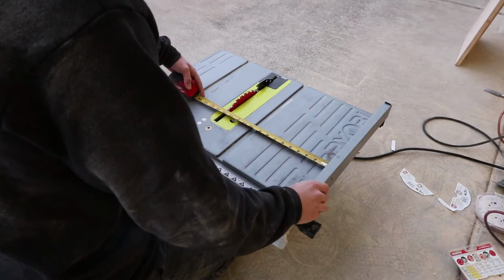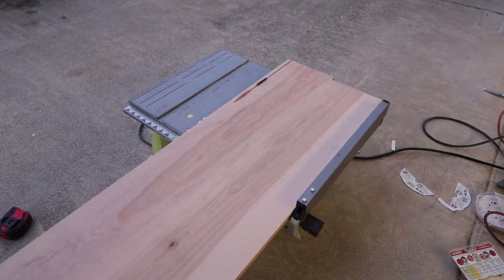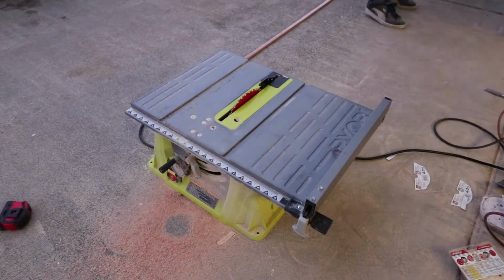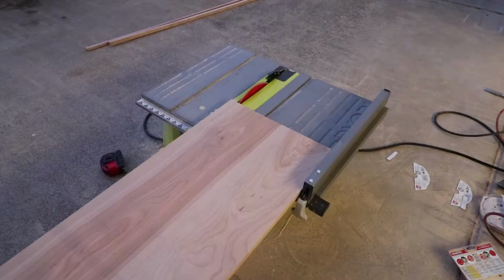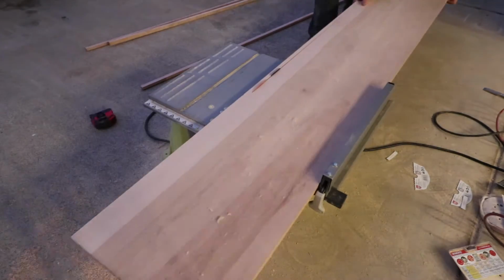It was now time to trim up the boards to the correct width. I had to have my dimensions set because once I trim a board, there was no going back. I essentially maxed out my table saw with these cuts. My goal with trimming the boards was to have the seam perfectly centered. For good measure, I only trimmed up a board right before assembling it to prevent any mistakes. That way, I could remeasure before making any crucial cuts.